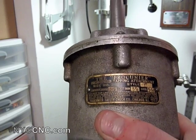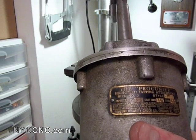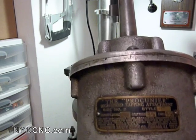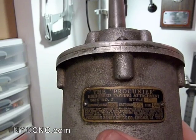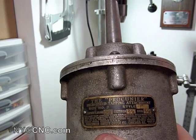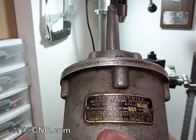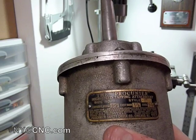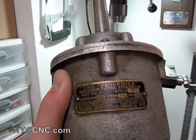There are a couple of differences though. First of all, you want to be careful if you're using one of these with really small taps. I've not even tried it with a number 8 or lower — it's more likely to break a small tap because of the amount of torque. So be careful if you're tapping an expensive part; make sure you test it first. This is a tapping head tutorial for the home shop user, so if you are looking for expert advice you'll need to do your own research. My research has indicated that while a tapping head like this will work fine for me, if you are tapping a lot of a certain size you may need to purchase a tapping head which better matches the torque range appropriate for that size, or one which is adjustable.